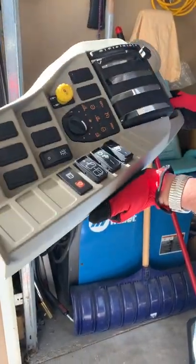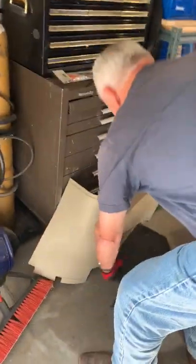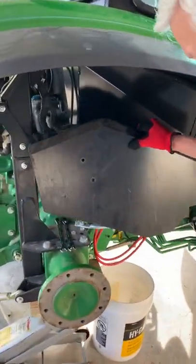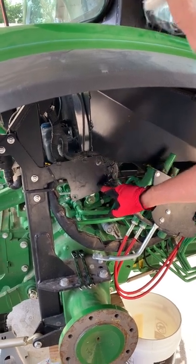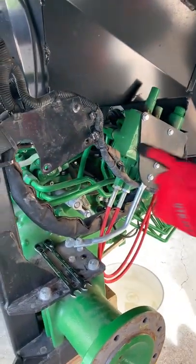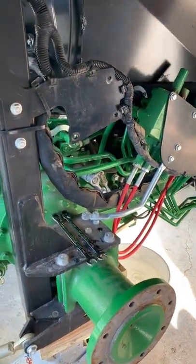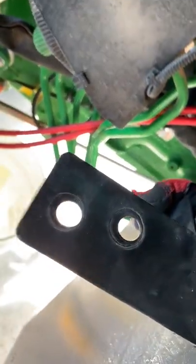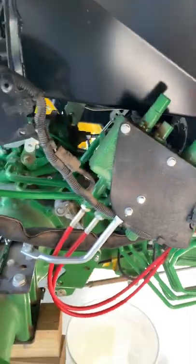I have a switch that's in the wrong place so I'll have to move one of these. We took our fender off — it was held on with three bolts right here. These are the three bolts that will mount our SCV, so I had to take those off. They were nutted to some bolts here and you'll save those nuts to use on the SCV. The bolts that held the front of this on I had to get loose and wiggle because they wouldn't come out.